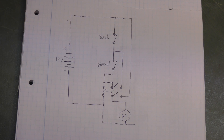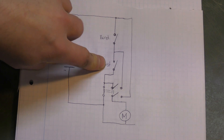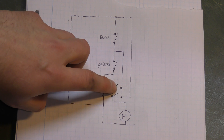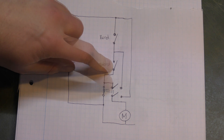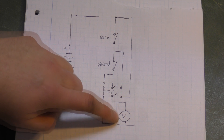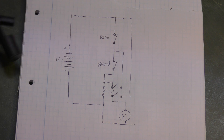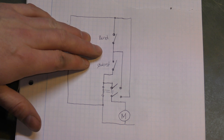From the battery we power the bottom switch. When that connects, nothing will happen until the top switch also connects — that powers a relay. The relay turns on two contacts: one powers the pump motor, and the other powers itself, keeping the relay on even after the top switch disconnects. The relay stays on until the pump drains the well enough to disconnect the bottom switch, then it shuts off and the cycle restarts.